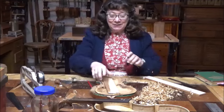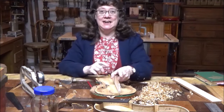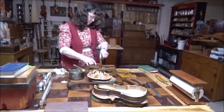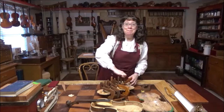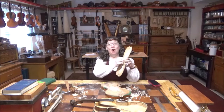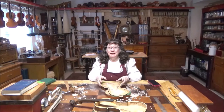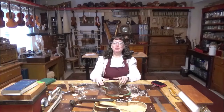We've got the graduations done and now I've got my very nice aged wood just cut down and ready to fit a bass bar. We're ready to get the bass bar in — we've got our hot hide glue. Time to take the clamps off and form our bass bar. We've got the bass bar all formed; it's got a nice curve in there and the sound is very responsive, so I'm excited for that. I didn't get video of me carving because I've been talking to the owner of this violin — his name is Gerald Tackett from Missouri.